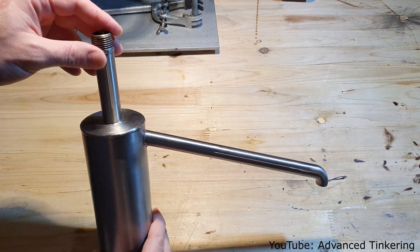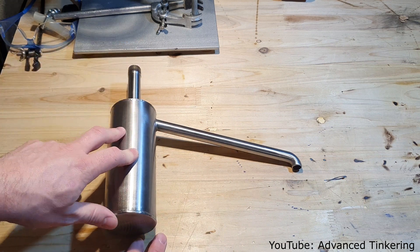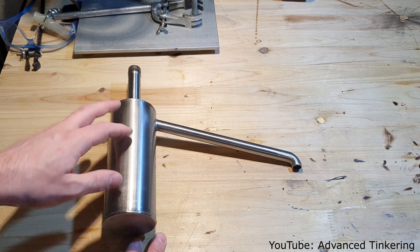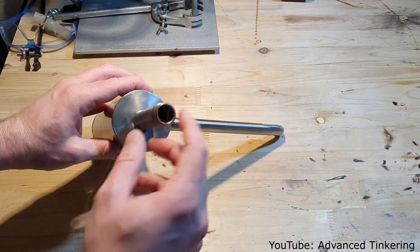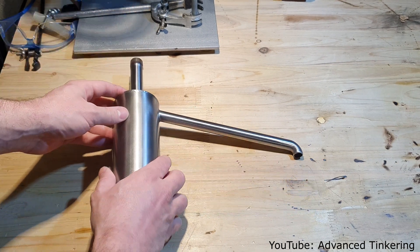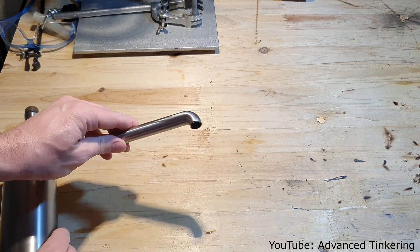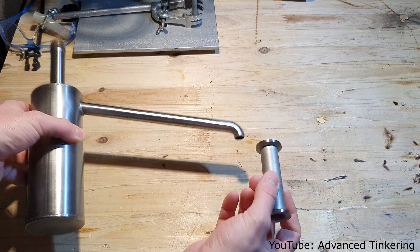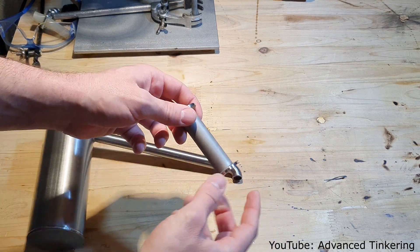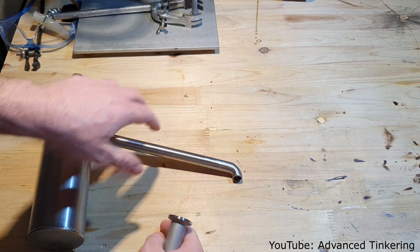This is my new design for my cesium still. It is designed to produce a lot more cesium in one go and it is way simpler than my last design. I think I heavily over-engineered the last one, so I won't need any gaskets here made out of Klinger Milam. It's not as convenient because you have to fill it through this smaller opening, but I think it will work. It is made of stainless steel with two millimeter wall thickness, and my plan is to use a QF or KF fitting on the end so I can connect my receiving flask without issues from different coefficients of thermal expansion between the metal and the glass.